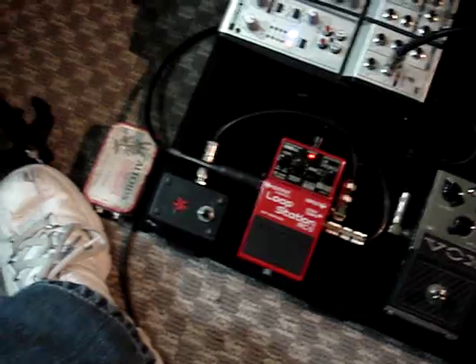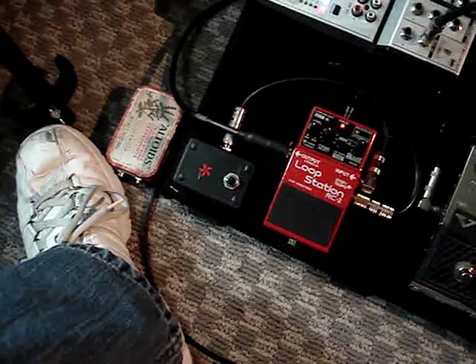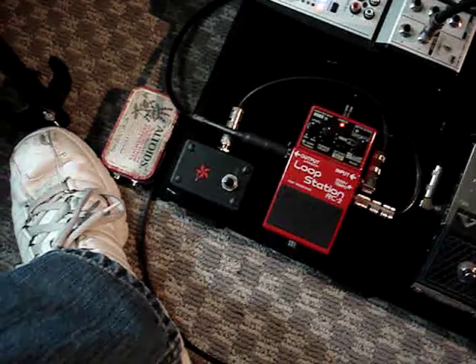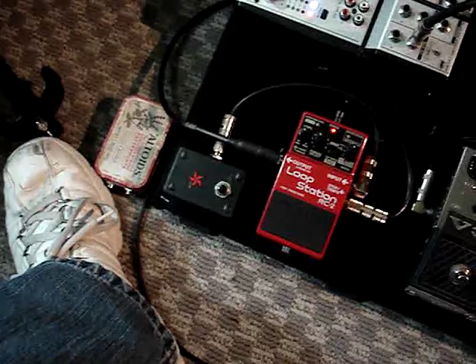It thinks that you're holding the button down all the time, not off the switch all the time. So go to Digikey or Mouser or something and find yourself a normally closed push button switch. You're on your own to find it — I bought this from a supply store locally, so good luck with that. See you next time.